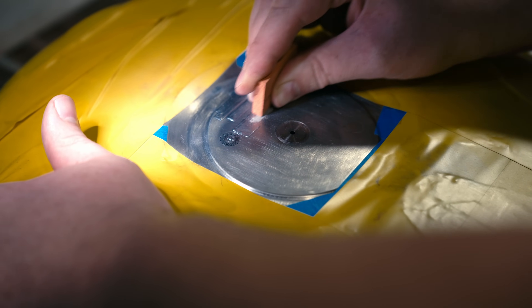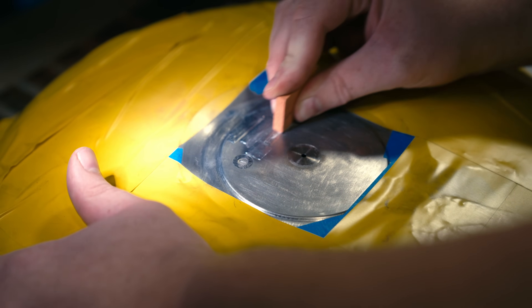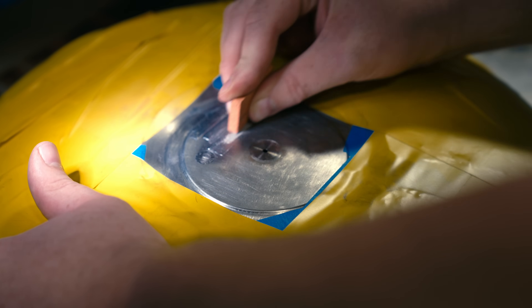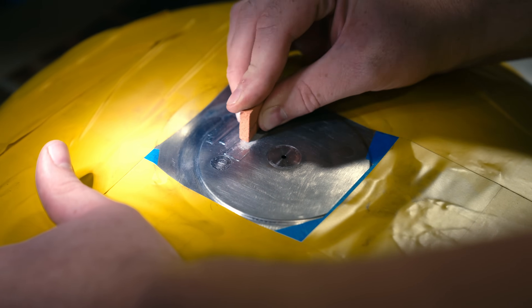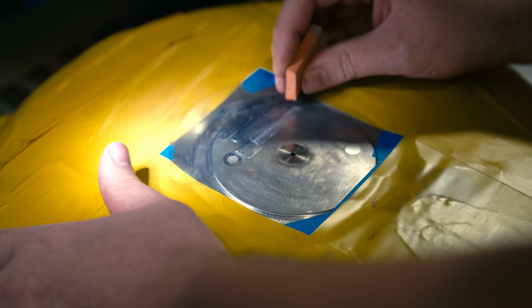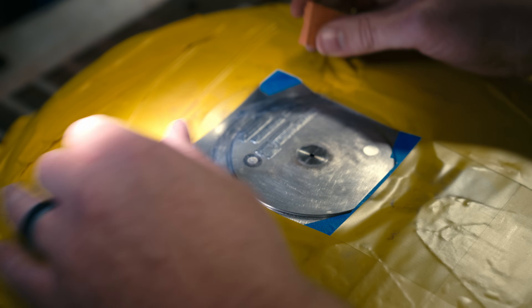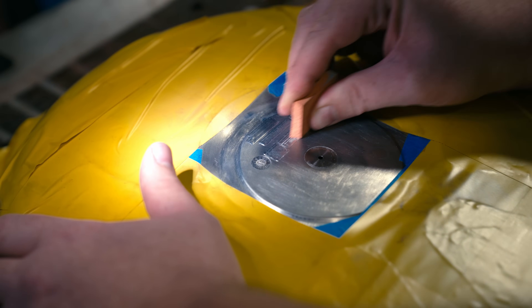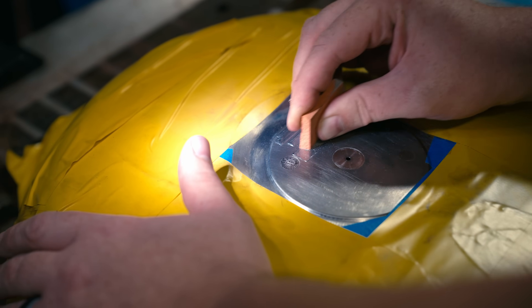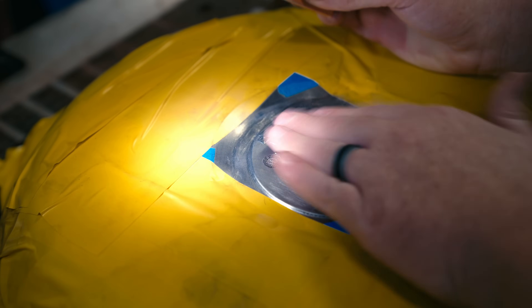I don't want to go in there with a big deburring tool. I want to go in and just finesse that weld right down. It's going to be a little bit time-consuming to hand bench off, but at least I don't have to throw it on a machine or take it up to another operation — I can just do it all right here. And there's a lot less risk with the stone too. If you use a pneumatic grinder or something, you could damage some other area on the molding surface — you could easily put a divot in it. I'm going to use this stone to knock off all the highs and then go back through with a finer grit as I get closer to the base.